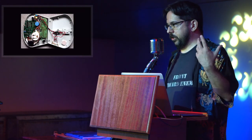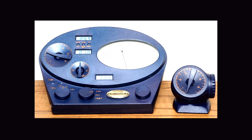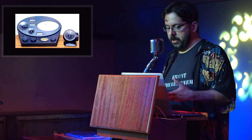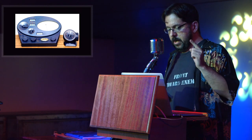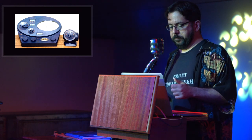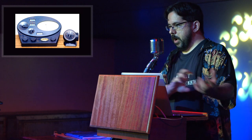I also took a picture of the inside of this — it's a Mark VI electropsychometer from the 70s. That large chip on the left is the clock chip, with some discrete logic that goes along with it. This is the Mark VII electropsychometer — this one has Intel inside. I am not kidding: it has an Intel 8051 microcontroller. The reason they did that is because they wanted to be able to train other Scientologists in auditing. This device can sample the position of the tonearm and the tonearm counter, and an extra display shows the tonearm position and the position of the needle, transmitting that to a remote device so people can monitor what's going on.